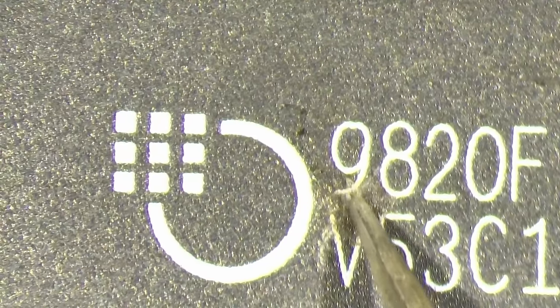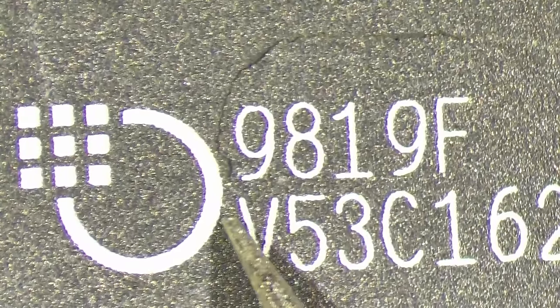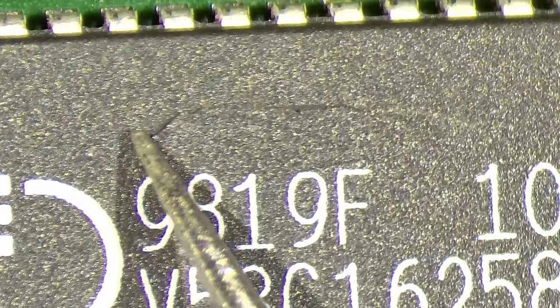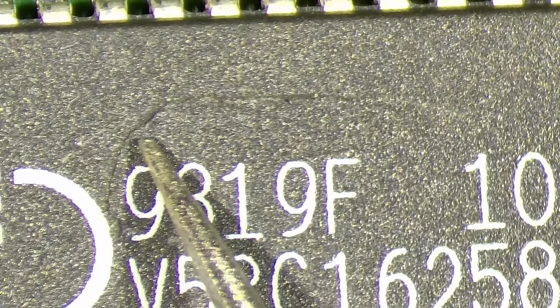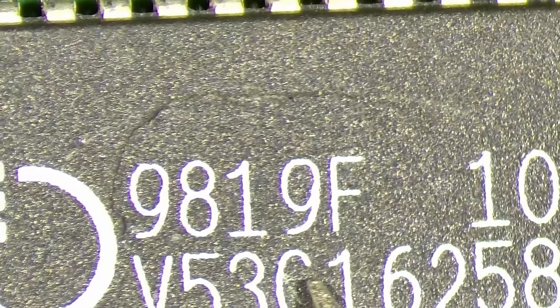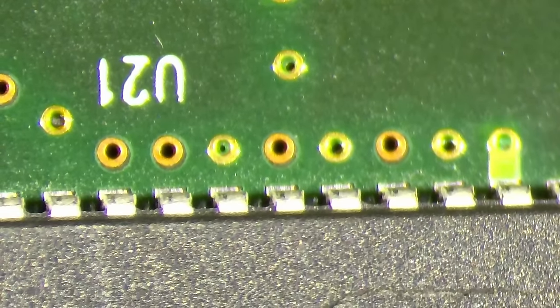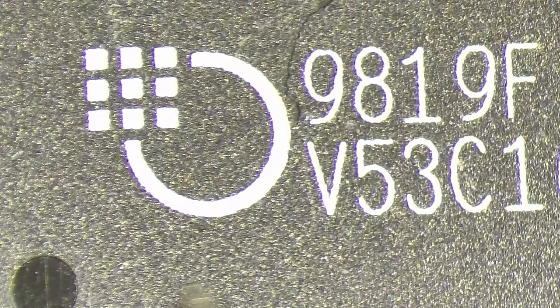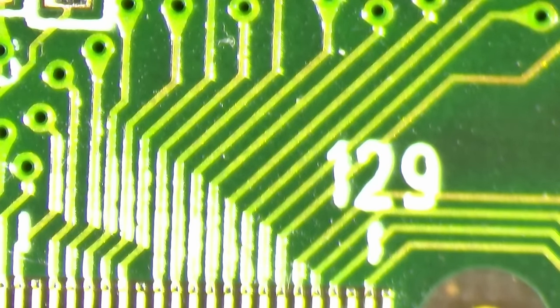But it's also again on that same spot. So this one here looks okay from the color perspective, but it has a crack all around here. You see this here. So this definitely needs to go. This chip probably is dead. Now that, because I don't see any discoloration on this chip, now I'm worried that all the other chips may actually be dead as well. So I'll power on my hot air station and I will go ahead and remove those chips that we have seen and see what happens to our short on the connector that we have measured before.